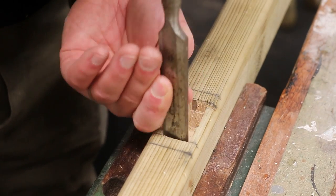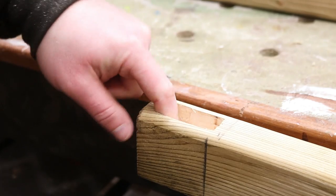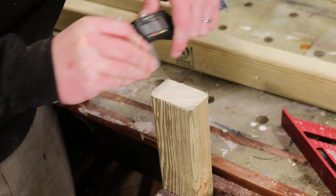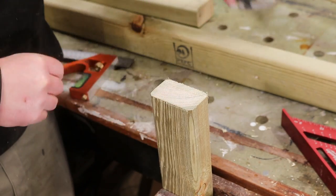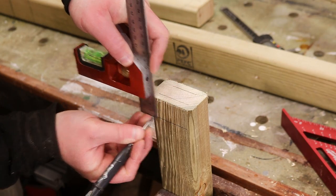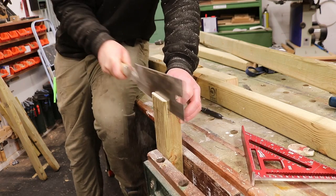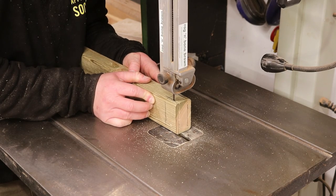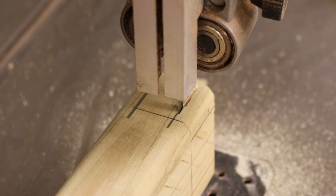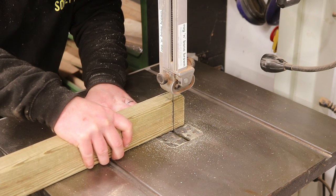I can then use a chisel to square up the mortises and clean up the walls where needed. I used my calipers to measure and scribe the end of my rails ready for cutting the tenons. I'm using a pencil here just so that these lines show up better on camera, and my combination square is used to mark up the length of the tenon. Using a Japanese pull saw to cut the cheeks of the tenon is a good option, but using the bandsaw makes things quicker. And I'm making sure to stay on the waste side of the line so that I can refine the fit of each tenon with chisels. And I can cut the shoulders there too.